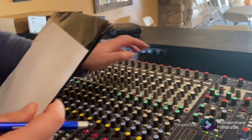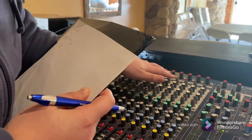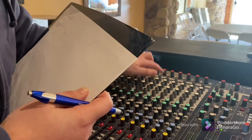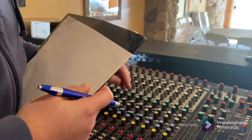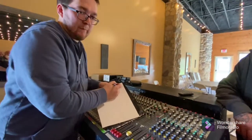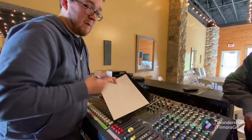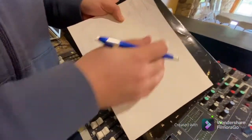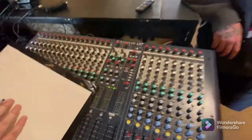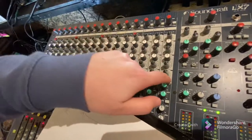Your favorite switch is the low-cut switch. When in doubt, try it first. If you're trying to make something sound better and everything is too rumbly — especially with a subwoofer system — try the low-cut first. We'll talk more about using the low-cut switch as part of your homework assignment after our demo. Now what if we don't want to cut the bass — what if we want to boost it, make it fatter or bigger sounding? That's when we go to the actual equalizer section.